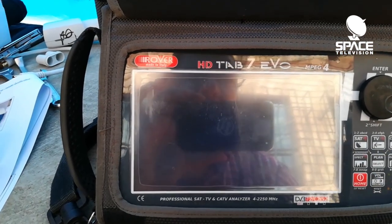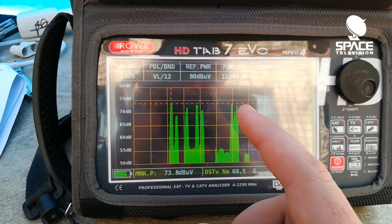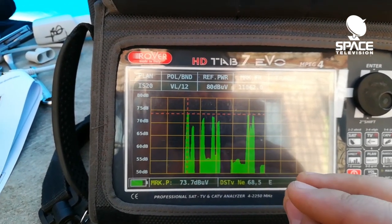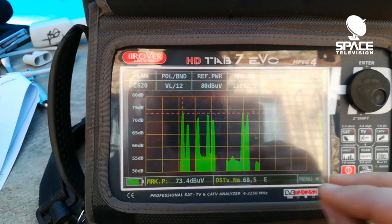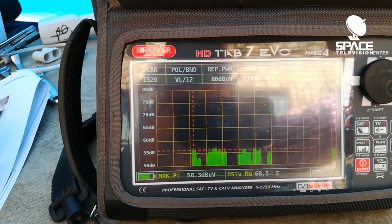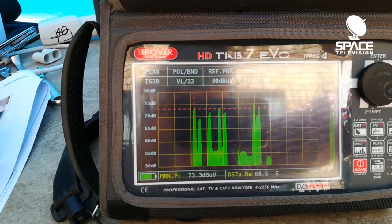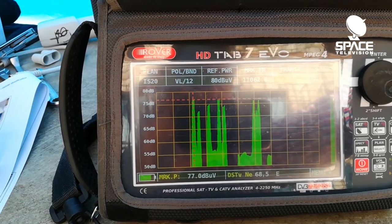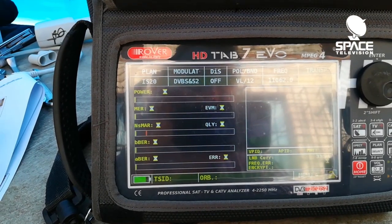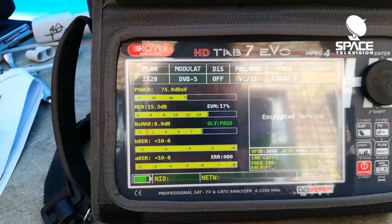Another tip: if you flip over to spectrum mode, especially when you're in the initial phases of panning the dish, you will see a few spikes appear — this is not a normal satellite spectrum. If I move my dish out of alignment, those spikes become distorted, but the carrier is still there. As my dish slowly moves into alignment, you can see those carriers grow, the signal-to-noise ratio improves, and then we just put it back to satellite mode to deal with the final tuning.